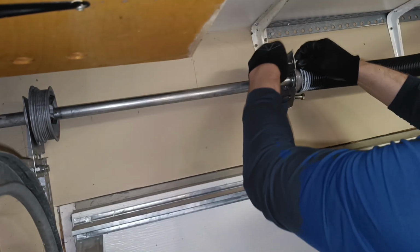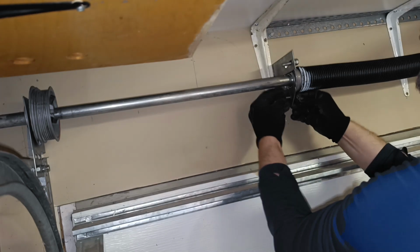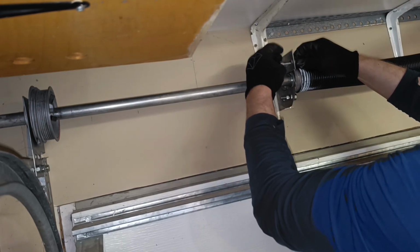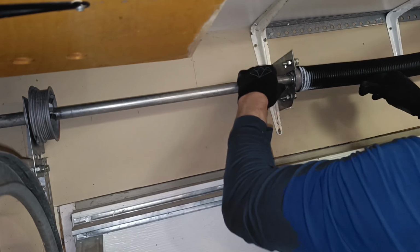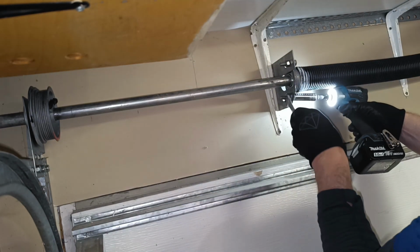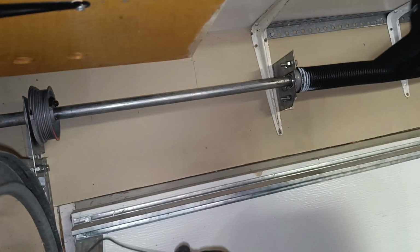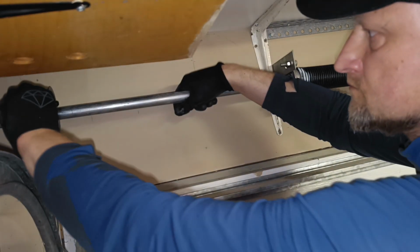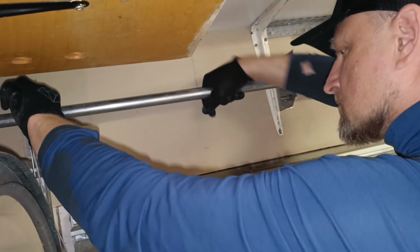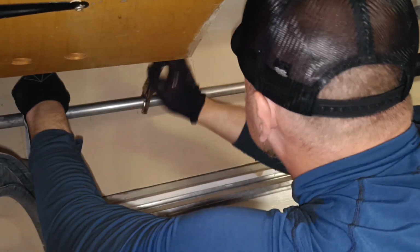We attach the stationary cone to the central plate. The right drum isn't attached yet. We connect the cable to the left drum and tighten with slight tension, rotating the drum around the axis. Secure the vice grip on the shaft so the cable doesn't unwind.